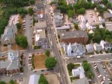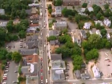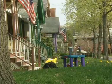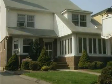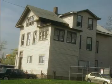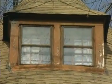You might wonder, what does working Lead-Safe have to do with your project? Let me explain. You're probably going to be working on an older home. If it was built before 1978, it might have been painted with lead paint. If it was built before 1960, it probably does contain lead paint, especially on the doors, windows, trim, stairways, railings, and porches. If that old lead paint is in good condition and you won't be disturbing it, it shouldn't be a problem. But if you'll be sanding, scraping, or otherwise disturbing the paint, you're almost certainly creating dust and debris that contains lead. And that can be dangerous.